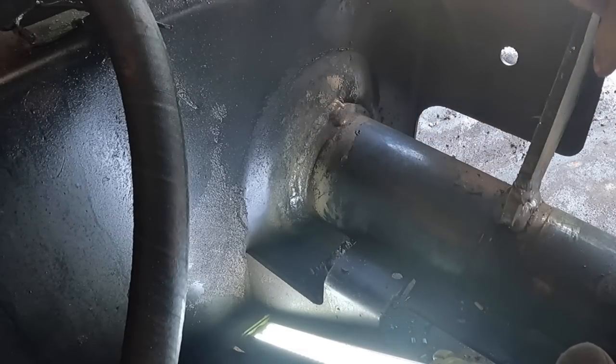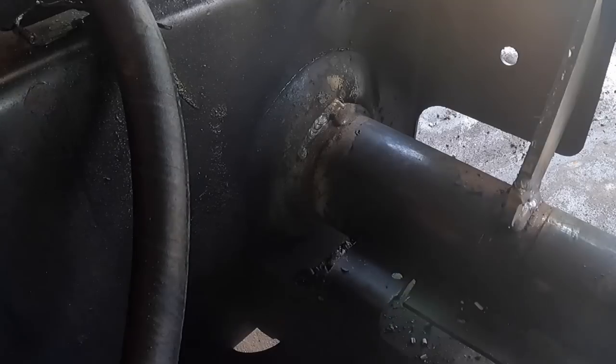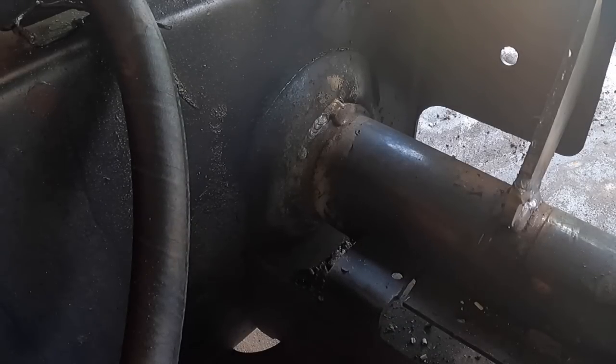Across here. Oh, yeah, that's still hot. Oh man. Yeah, I'm okay with that. I tell you what, let me run a really hot, like a 6010 pass on it. Give a real hot burn in there, you know? Yeah, like a root pass. Yeah. A real, real hot one.